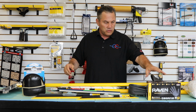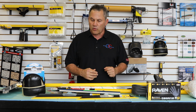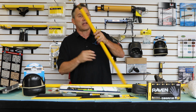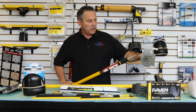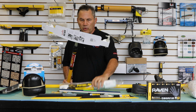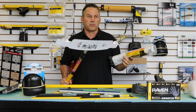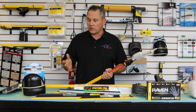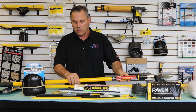So now that you've got your gloves and your cleats and your squeegees, put the epoxy down on the floor, and now you've got your application tools. You're going to need an extension pole with an 18-inch handle. You simply screw this on, okay? You're going to want to put your 18-inch roller cover onto the handle, and then you'd be ready to back roll your epoxy before you would put flake, or if you're just going to leave it as a solid color, you would be finishing it off with that.